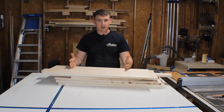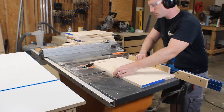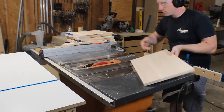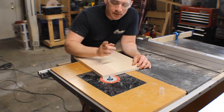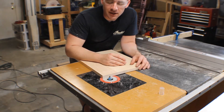Now it's time to cut them down to length back on the table saw. Now I've got to put an edge profile on these things with my router. Today I've got an OG bit in there. I'm going to try and church it up a little bit and make it look nice.